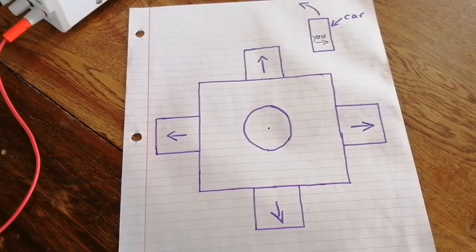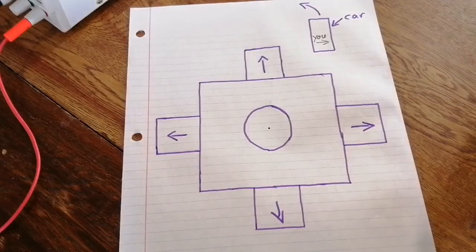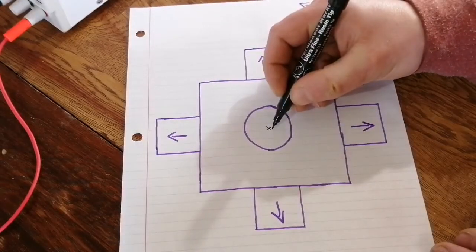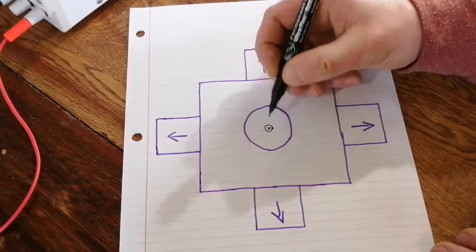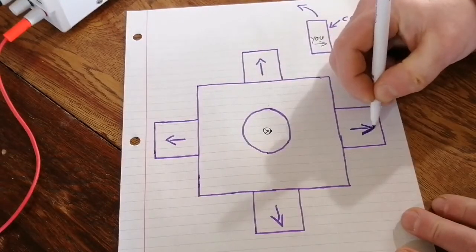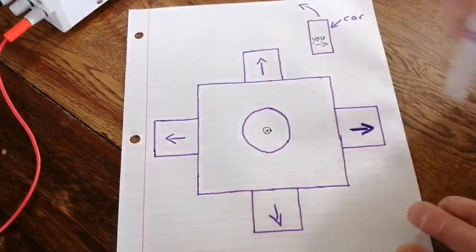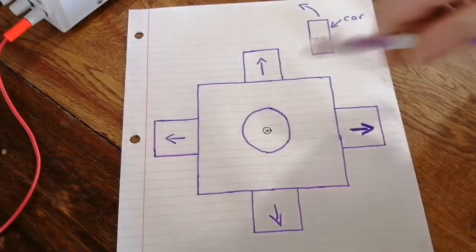And it did spin at thousands of RPM before. I don't know what it is now, but it spun much faster before this vibration started. Now, of course, I'm not a factory, so even though it was fairly well balanced, it was not at all perfectly balanced. So let's say that instead of here, our actual center of mass is right here. That means that the path that the center of mass is traveling is going in a circle. And of course, that means that the amount of centrifugal force on this side becomes a little bit greater. I can't really draw this arrow getting smaller, but just imagine that every time this arrow gets bigger, this arrow gets smaller. So that puts a force on the shaft.